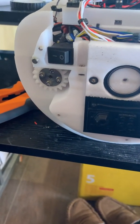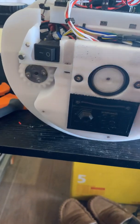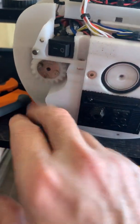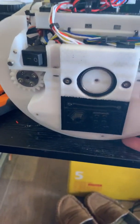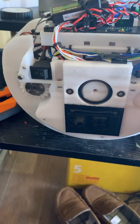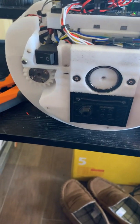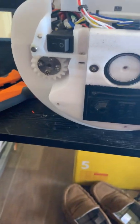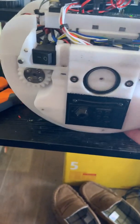The main thing you're doing at this stage is making sure that these motors are wired with the right polarity. If you get the polarity wrong, what will happen is you'll get a bit of a tick and then literally D-O will just shoot off. It is a bit dodgy that way.